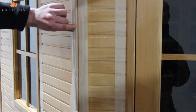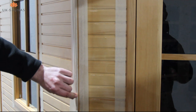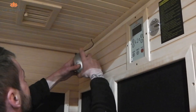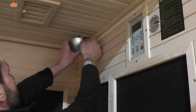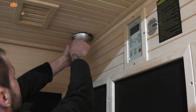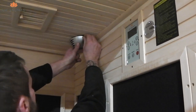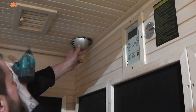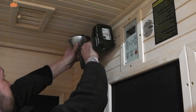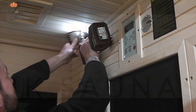Once all the masking tape is in place, you're then ready to start sealing using the clear sealant that's included with the sauna. You now need to fit your ionization and sterilization unit to the inside of the sauna. This unit simply plugs in and screws up to the ceiling on the inside of the sauna. Full instructions on how to use this are included — please read them carefully, because you cannot be inside the sauna while sterilization mode is switched on.